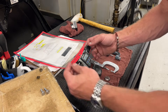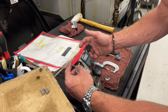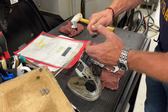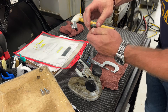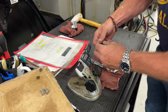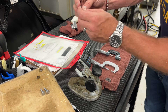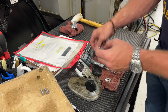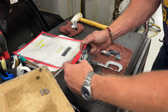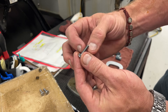We're going to do a quick spot check based on the print — check our thread major, we got a critical diameter in the back, we're bueno. Check our thread gauges all the way up to the shoulder, which is what we want. I already gave it a visual inspection — it's one of the first things I do. Check it visually, thread's good, check one more time that critical, check our milled hex — 375. It's a part, simple little part, looking good.